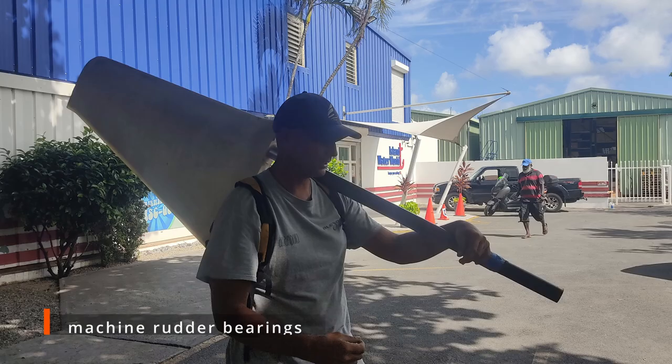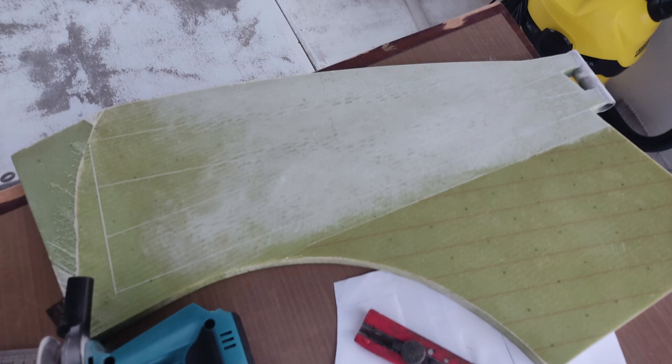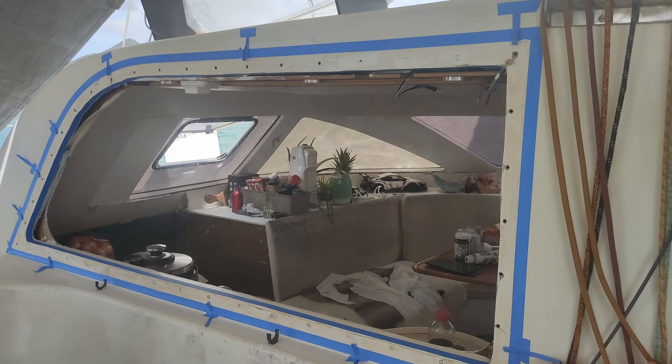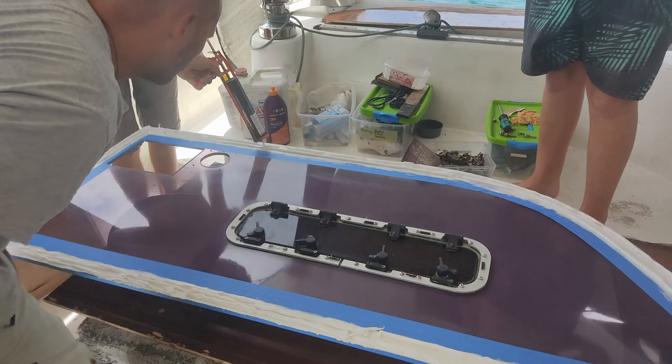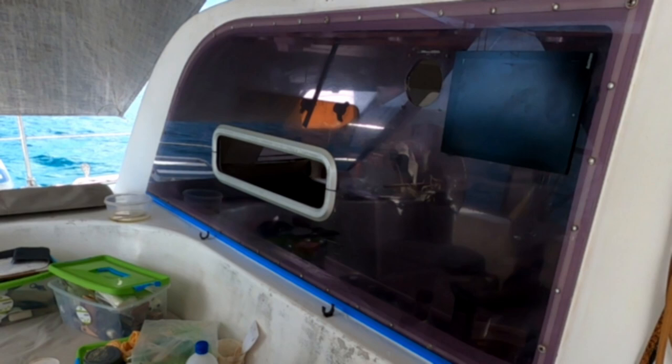And we are currently, so we need the chain plate because our starboard chain plate's pulling out now. We've already done the port side. So this is the bulkhead, the replacement bulkhead, because the bulkhead's rotten again on this side, same as the other one. And then this is the new carbon chain plate that we're just putting straight onto that. And then we laminate the whole new section into the bulkhead. In addition, we've had to seal all the windows because the windows were falling out. So it's not good if you have windows falling out.